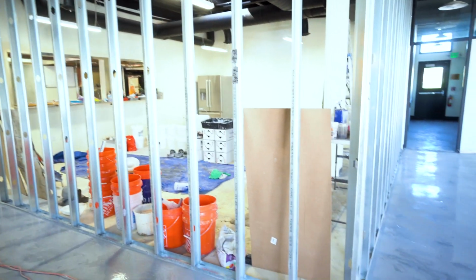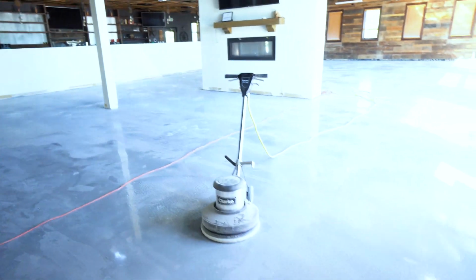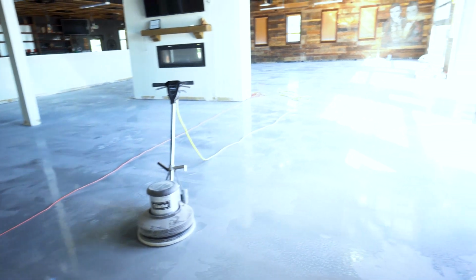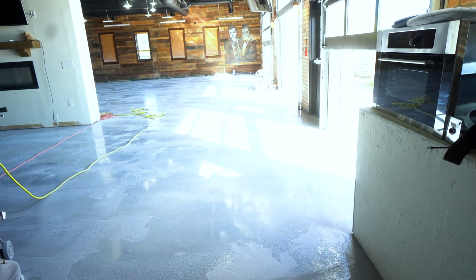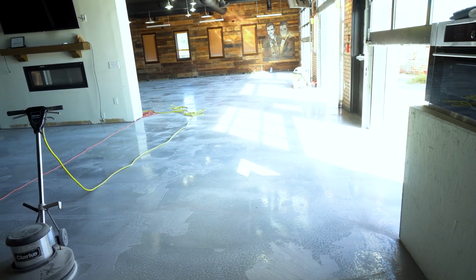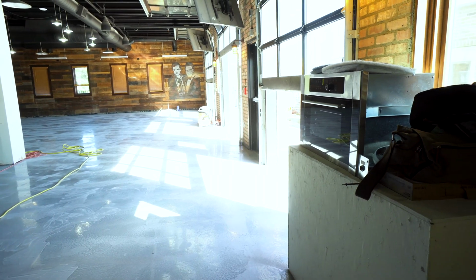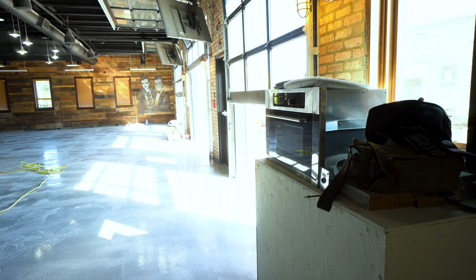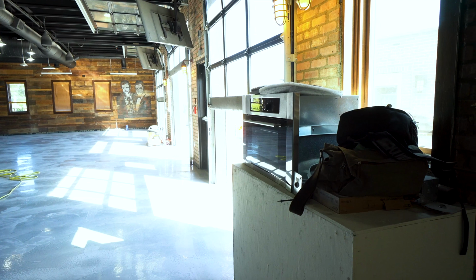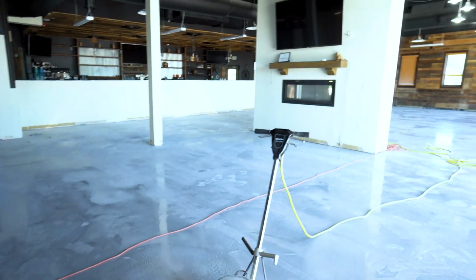I use a thickening agent and then just do repairs that way. And then you come back through and do an 80 grit with that little guy, or a couple of those guys we had in here. 80 grit screens. They're actually 80 grit. And then look at it again, kind of see where you are. Take the 4-inch grinder and just pop off any little knobbies, anything that looks a little too high that this guy doesn't get. And then just keep working through it and working through it.